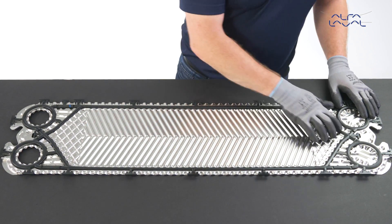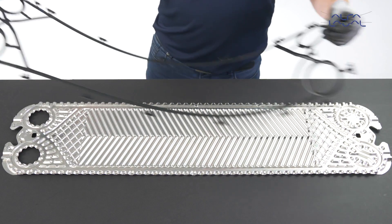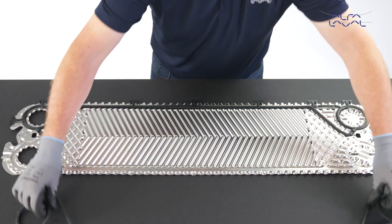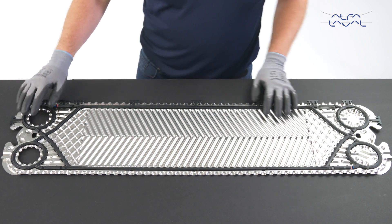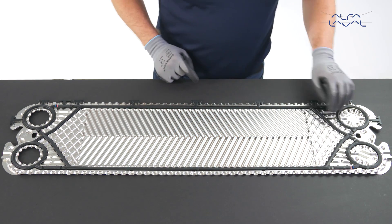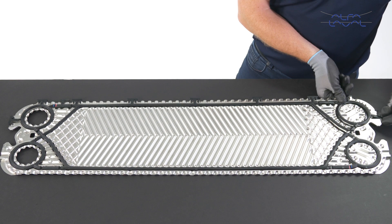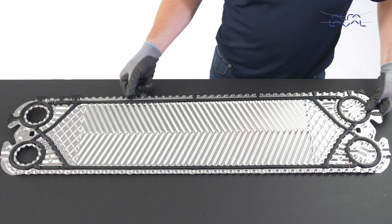There is a designated gasket for End Plate 2 plates. However, if the End Plate 2 gasket is not available, it is possible to make one by using two regular channel plate gaskets. Cut the two channel plate gaskets in half and use the two pieces with complete ring gaskets. The clips and connection beams must be removed on one of the halves. Tape the two halves together — we recommend using GC1 double adhesive tape. Remember, do not put any glue or tape in the ring gasket areas.